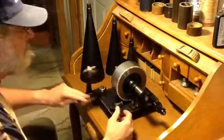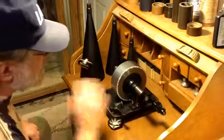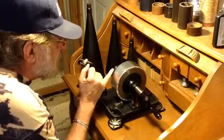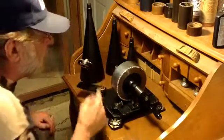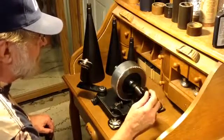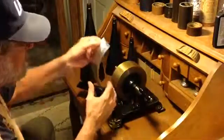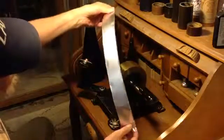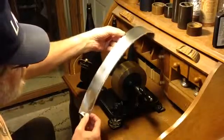But it's really surprising. If you're slightly touching one of the groove walls, your recording is gone. It just does not work. It has to be absolutely dead center in the groove where it's indenting the foil. Remember, this is indenting. It's not cutting anything. It's just indenting aluminum foil. And when you take the foil off, you have a series of what are essentially dots. I doubt if you can see that. But it's just a series of dots, and some are deeper than others, but it's vertical modulation.